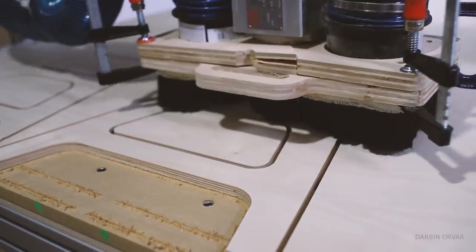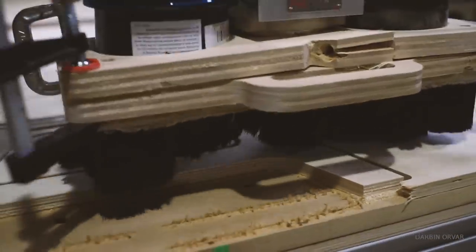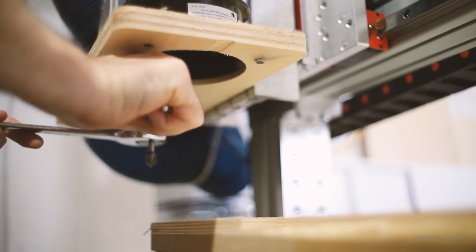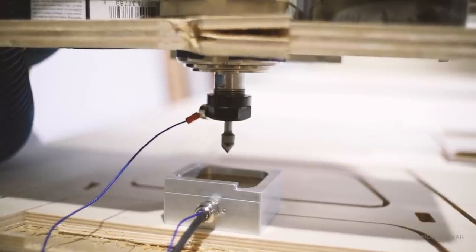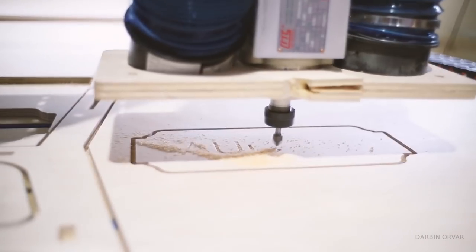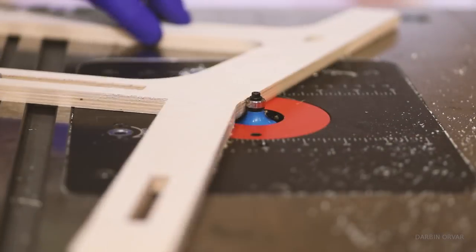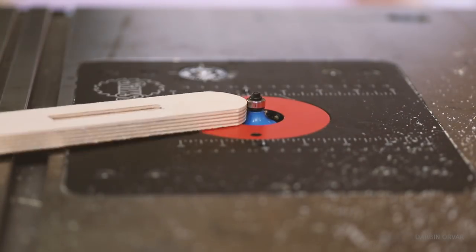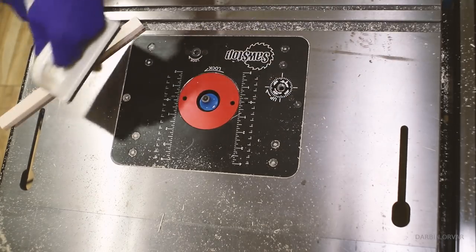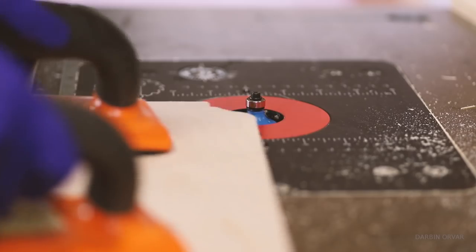Don't be too conservative when you position your pieces out on plywood — I had some cuts really close to the edge and they just teared off. I also thought it would be nice to add an engraving to the back, so I switched to a 90 degree V engraving bit. One thing I realized is that routing the sides of the pieces is a rather important step: it makes the chair look better but also eliminates the step of having to round the sides of the rails to fit into the slots in the sides of the chair.